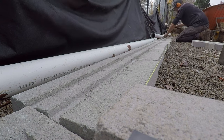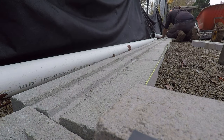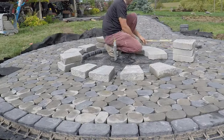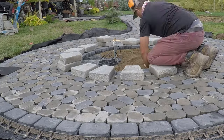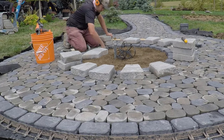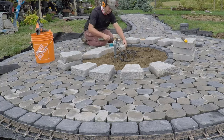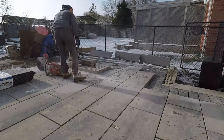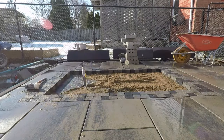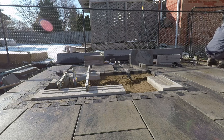We lay out the paver base panels for the patio separately. It would be a pain to have to screed a little bit of concrete sand on top of the paver base panels to lay that wall completely level, especially if it's a longer wall. Eventually our concrete sand layer on top of the paver base panels would be too high for that wall to sit on. So walls I actually won't do on paver base panels. But fire features are a perfect use case — and that's gas burning only, not wood burning. We lay out the patio, cut out an area for the fire feature, and use concrete sand to level it. It's not as long as a retaining wall, so it's much easier to level with concrete sand on top of the paver base panels.